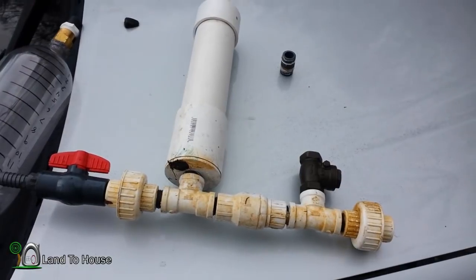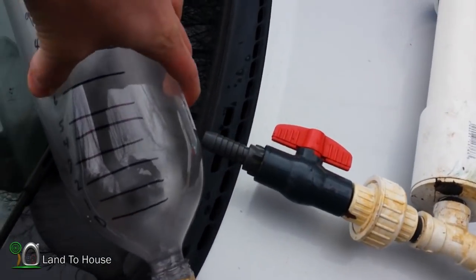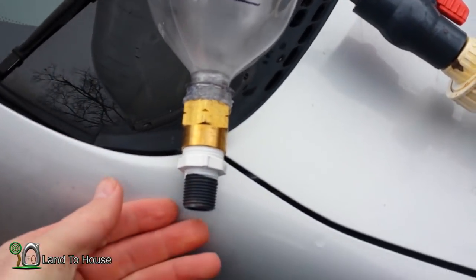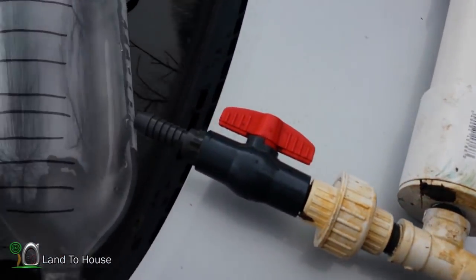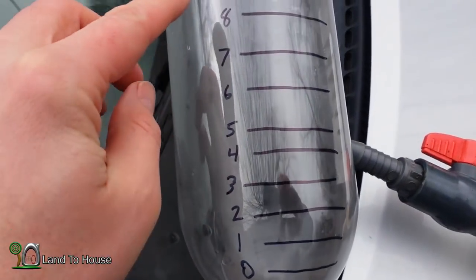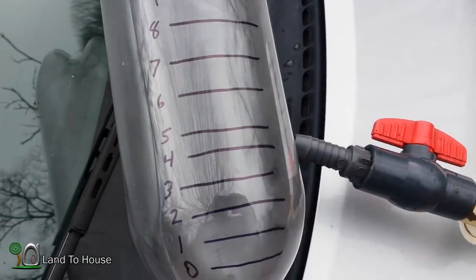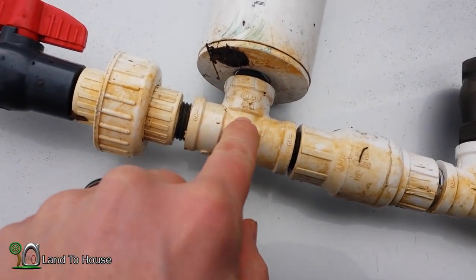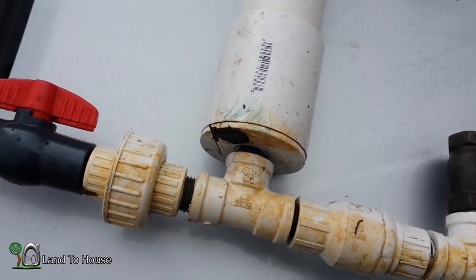Here's the half-inch ram pump, and I've made this coke bottle gauge so I'll be able to screw this on to the pressure tank. I've got some numbers on it to see if this gains water as we pump, and then I'll be putting a tiny hole in here as a snifter valve to see if little bits of air go into the tank.